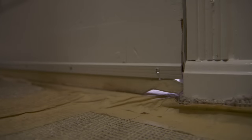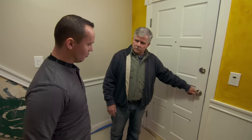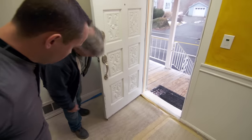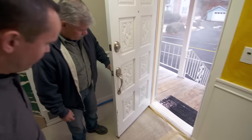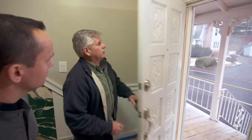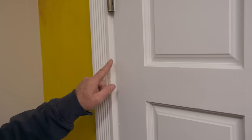Look at the carvings — this is a nice door. We're trying to save it because we think it's beautiful and probably original to the house, but the draft is killing us. It looks like you have a gap on the bottom. We took about four layers of previous floors and put one more layer, and because of that it created that gap. Also, the door is too thick for this jamb — the door should be flush or slightly inset to the jamb. But if you're up for it, I'll get some tools and we can fix this.